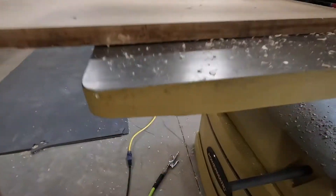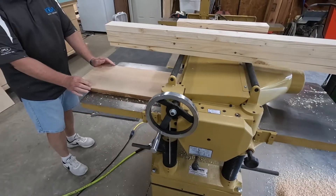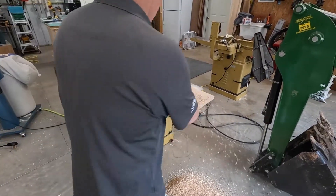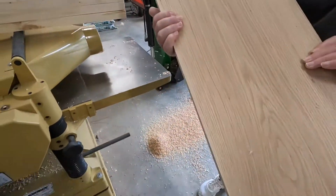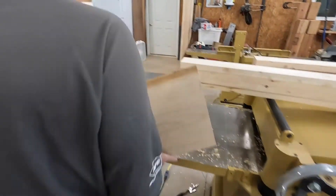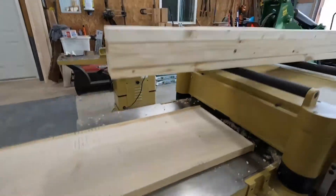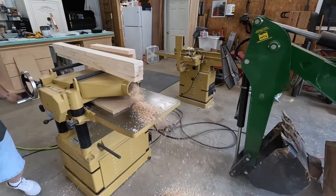This white oak board was taken off of our property — we cut the tree down shortly after we bought our home. This log had been sitting around for at least a year to 18 months before we opened it up. We actually used our Wood-Mizer LT50 Wide to cut the boards. When the boards were cut, the moisture content was in the 30s — maybe mid-30s. After we got it worked up here, I put the moisture meter back on it and we're still in that 15 to 16 percent range, so still not to the point that we can use it for a project.